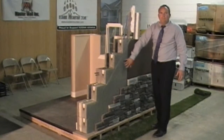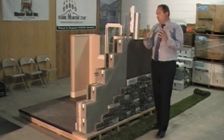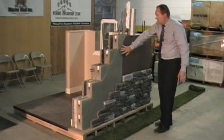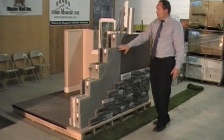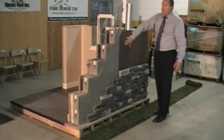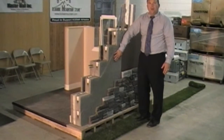The entire house will have these bond beams locking in both vertically and horizontally with the dry stack system, and then the surface bonding on the outside as well as the inside to lock it all together. On the outside, this surface bonding is now your scratch coat or brown coat. You can apply stucco, acrylic, rock, or whatever type of brick or siding you want on your house goes strictly onto this, which speeds up and reduces costs.